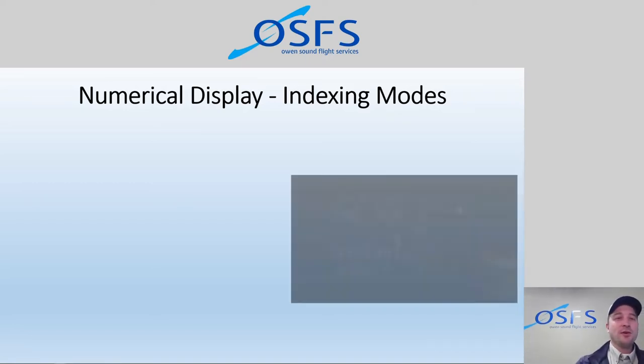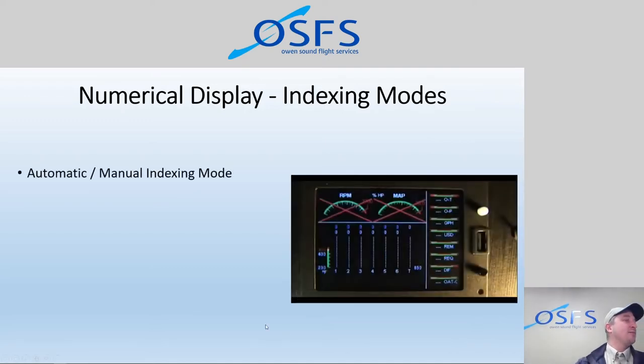So, the numerical display. Basically, we have options of what we want to display at the bottom of the unit. What we're seeing here is a horizontally mounted EDM. Ours is vertically mounted, so the bottom is wider on this display than in ours. But in either case, the numerical display will show up at the bottom. That display can typically show one parameter, maybe two if it's combined with CHT and EGT. But in the vertical, or portrait, orientation, it just shows one parameter. Any of the parameters that have probes installed can be displayed there at one time.